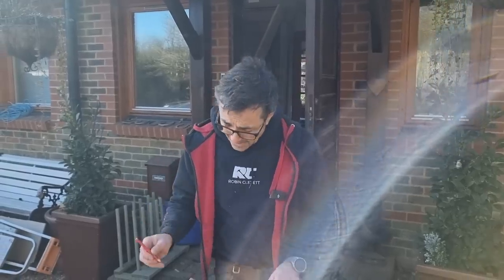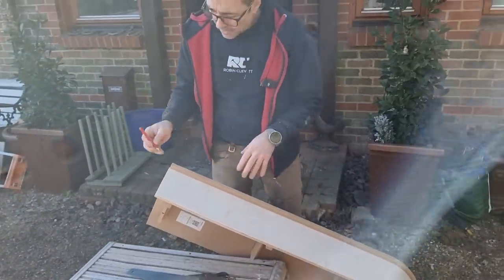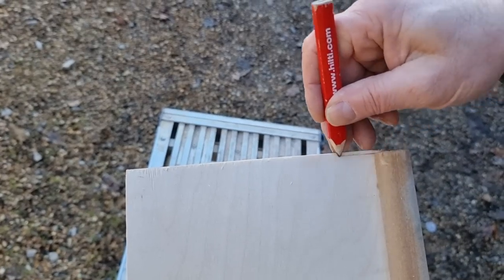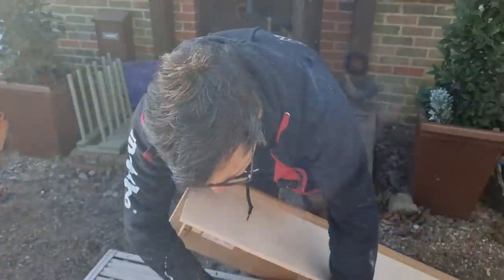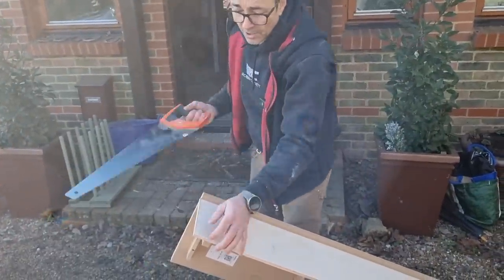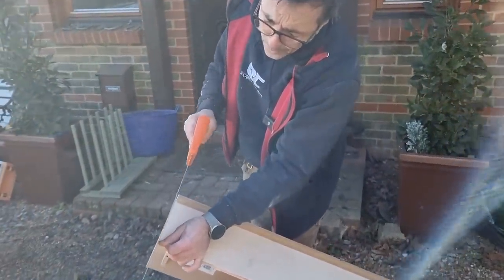So when you have a staircase manufactured, they all get manufactured quite quickly, and sometimes it's best to look at the components. Like here, the riser is just proud of the end of the tread. So what I'm going to do to make sure it all goes back into the housing exactly as I want it is just reduce that as well. It just makes it a lot easier to fix up if you're looking at there and you're trying to pull it tight and that's too long. So we'll just tickle that off as well, hand saw, back cut it a little bit.